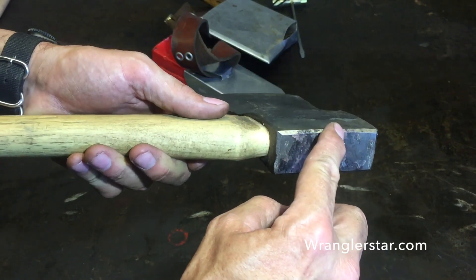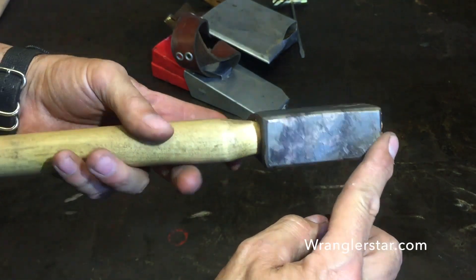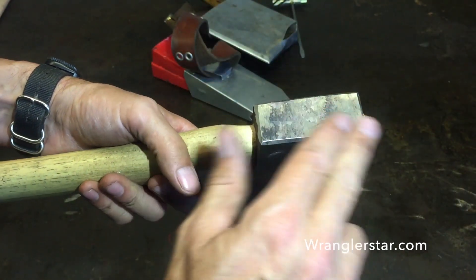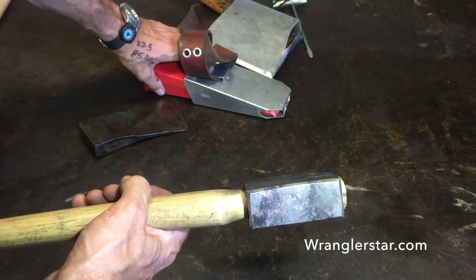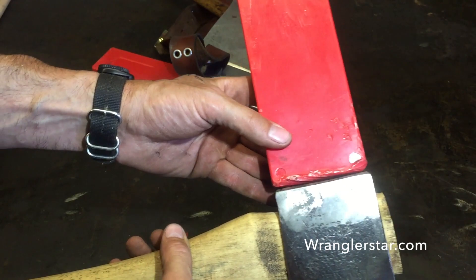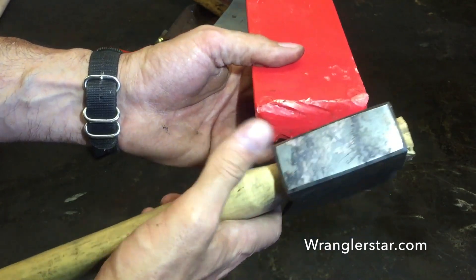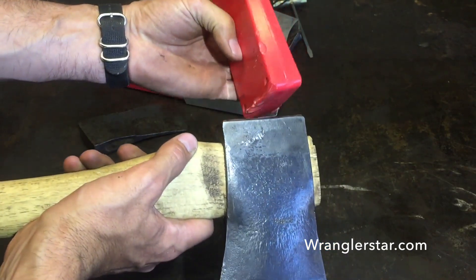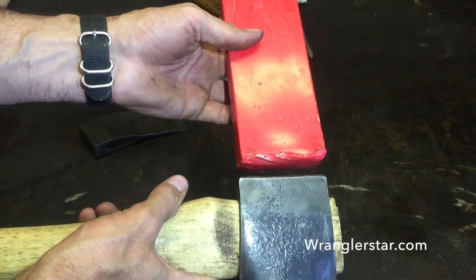What I did — and I'll finish cleaning it up — is I resurfaced the poll and took all that damage down. I put a really pronounced chamfer on there, chamfered on four sides, then machined the bottom as flat as I could by hand. These are the actual wedges I pounded at the saw class with this axe — see how nicely they match up. You don't want sharp edges on the poll because as you're beating wedges in at an uncomfortable angle, it'll just chew them up.